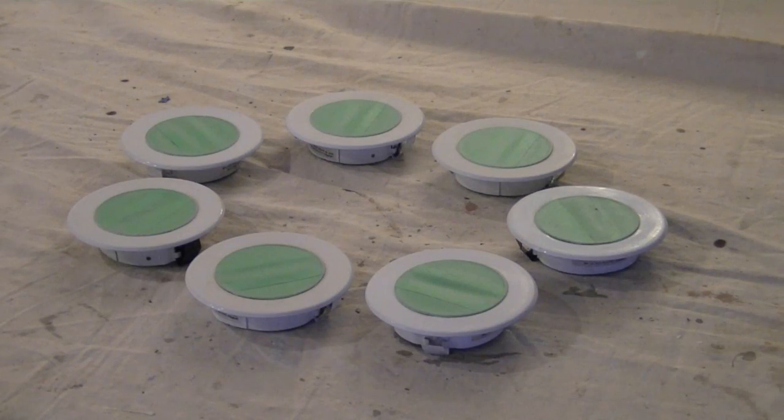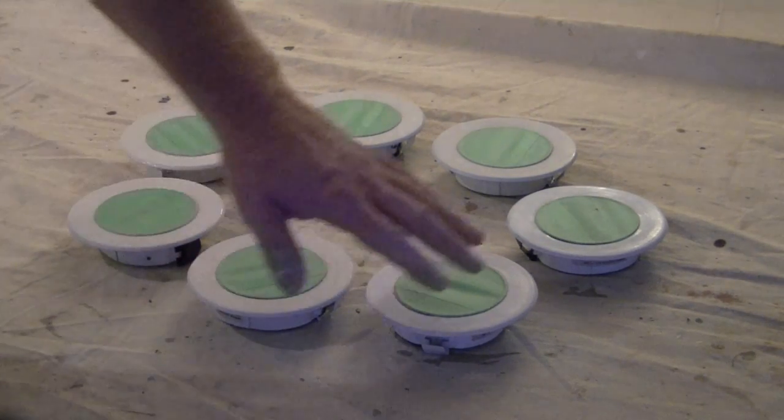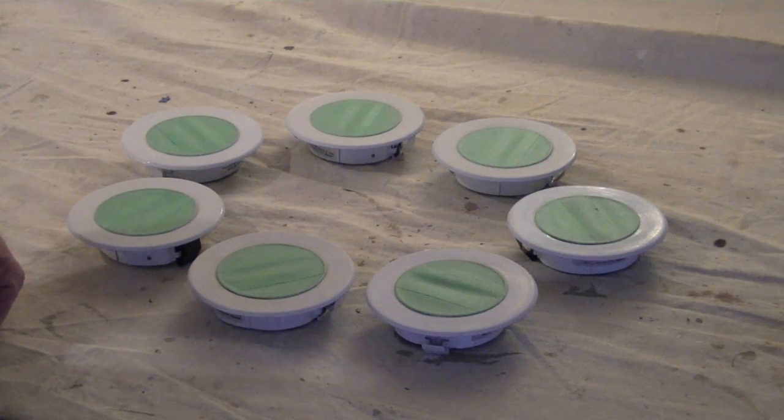It's a surface rust, so that's even better than trying to hide it if it does come off. But either way, our objective is just to dull this off so that the other paint has a better chance of sticking. So there you have it. So now you can see all the units have been masked off, trimmed around, and we've dulled all the surfaces, and all the rust has pretty much come off, which is great.